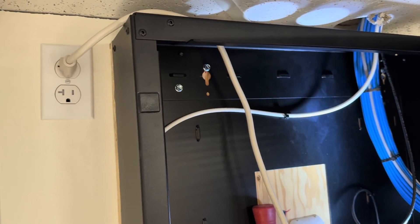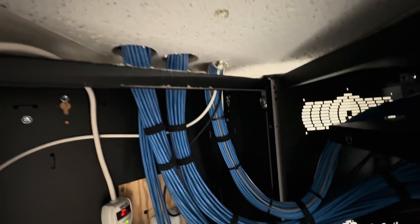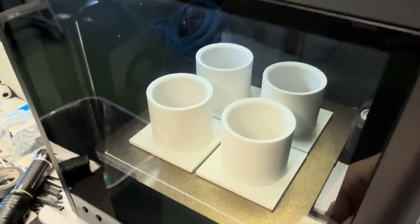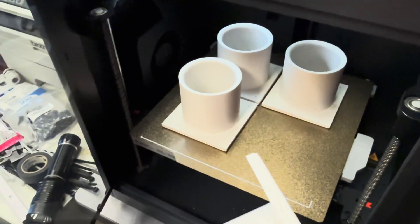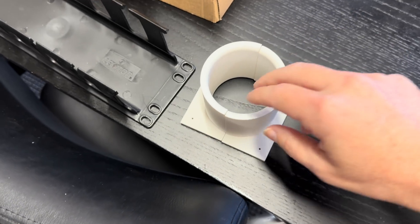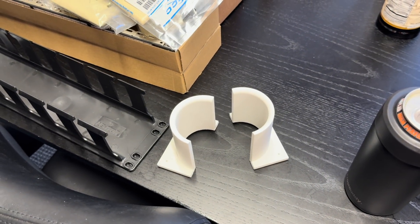Now the ceiling entry above the rack is still an issue. For now, we're just going to cut holes in the ceiling and bring all of our cable bundles through right next to the existing bundle. But I do have a plan to fix this. So that we can begin termination on the panel, we're just going to dig another hole right in that drop ceiling tile. The way that I plan to deal with this problem is with the help of my 3D printer. We're going to print out a little grommet that has a split right down the middle. With this, we can clasp around the bundle of cable and then secure the grommet over an existing hole in a wall. That way, I can take care of that one that was here before I got here, and the two that I've just made, and everything looks a heck of a lot better.